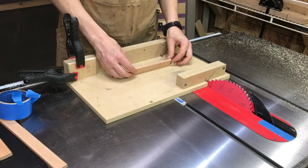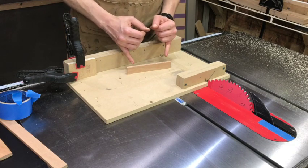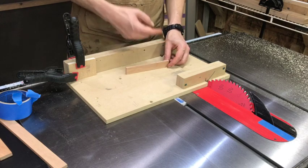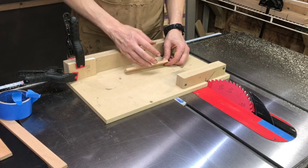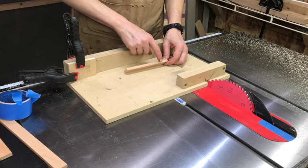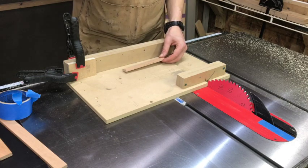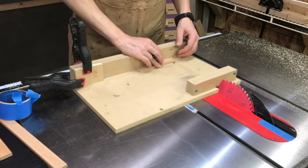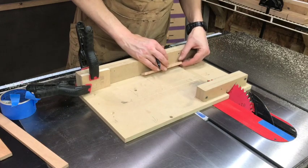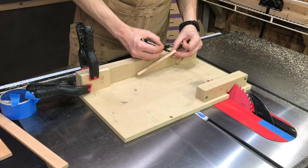Now, when we are cutting dimensions for our box and we're doing miters, we have to remember the dimensions are going to be from the outside points, but because the blade is at an angle, that means the entrance point will be further back. So when you're measuring, do not cut at the bottom of where this is with the top of your line. I hope that makes sense. Let's say my top is there. That needs to be on the peak cutting point. The blade will actually be entering somewhere down here, but that is not my measurement. My measurement is here, and we will line it up so that the cutting begins at the bottom of this.